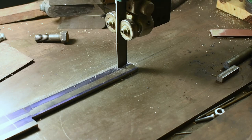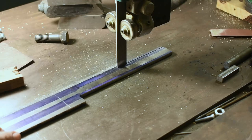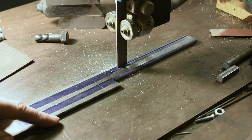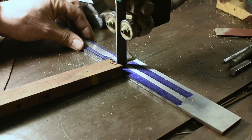Here I'm cutting the top edge bar. This is out of some bold ladder edge Damascus I made for another project — and for this project as well. I'm just ripping off a strip of that, and that's going to contain all the tops of the little triangular pieces from falling out of the billet on that side. But it'll ultimately be a part of the knife composition as well, kind of adding a little decorative top wave to it.